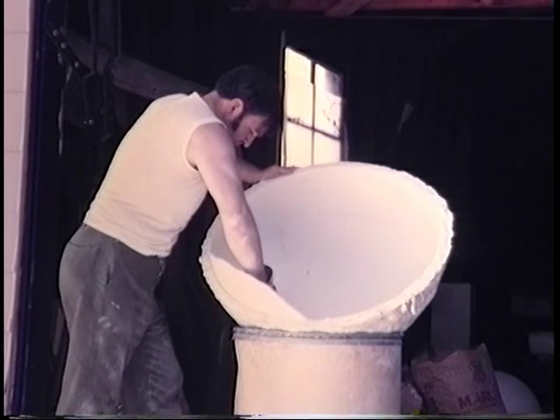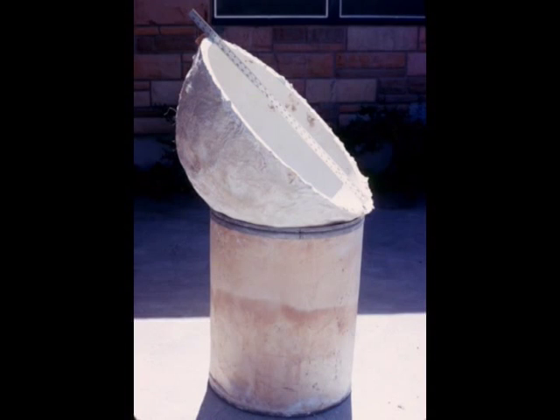Here I am shown grinding by pushing the plaster insert back and forth, which grinds away the surface. Here the hemisphere has been ground quite true and I've got a scale on here to measure the diameter. There are still a few holes and pockets in the plaster, but these will be filled up in the conventional lacquer sanding and filling process.